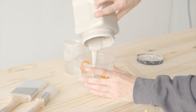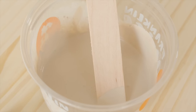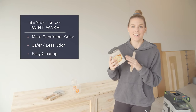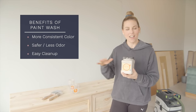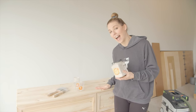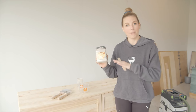I'm going to use a paint-to-stain technique today. I like this for two reasons: you get a more consistent finish and you're not working with an oil-based stinky product with flammable rags. Normally I thin it down a lot and wipe it back, but I'm not going to do that this time because I want to cover up a lot of these knots — I want this to look less like pine and more like oak. So I'm just going to water it down a little bit and put it on at full strength.